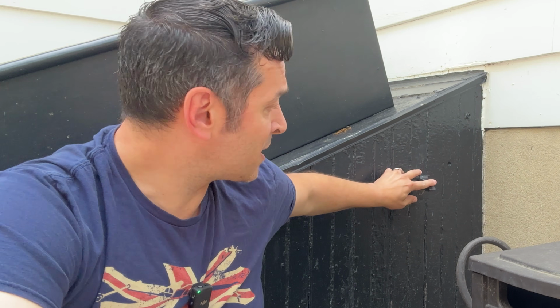We have an old house, and a long time ago, someone decided to put power on the back patio. And at that time, they thought they were doing the right thing by putting this weatherproof protector for the outlets. And while it may have been code back in the day, it's not code today. There's no GFCI protection on this outlet, and there's certainly no real weatherproofing for the plugs. So you can't leave anything plugged in and have it rain without possibly causing some issues.